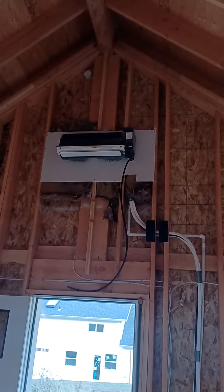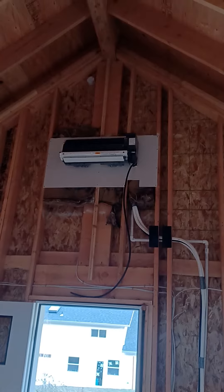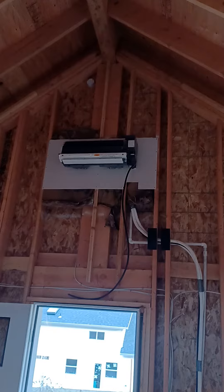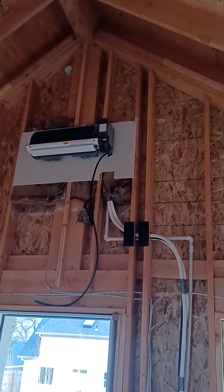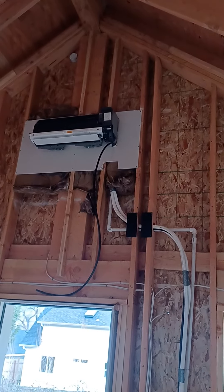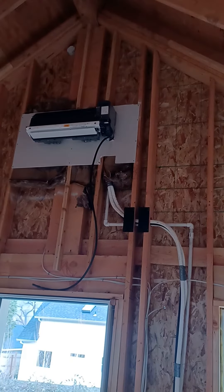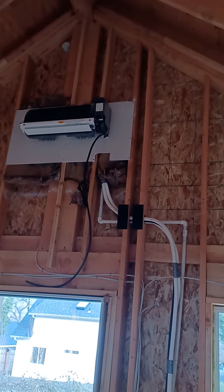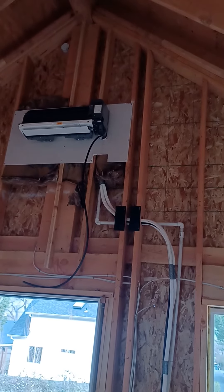I'll give a quick explanation of why we've gone this route. You can see this Daikin 12,000 BTU mini split is hung, and we have insulation and drywall behind it. The reason we're doing this now is they come with a quick connect — a threaded brass valve to connect the line set. What happens over time as that heats and cools, those threads back off and we get leaks in the system. So we've been cutting those off and brazing them in place, and that's why we're mounting them early.